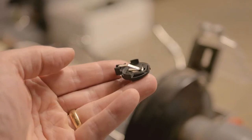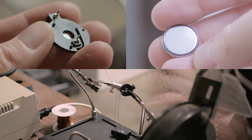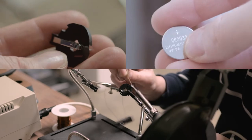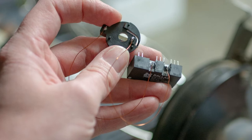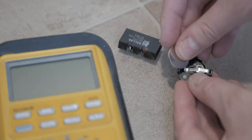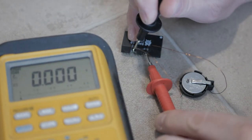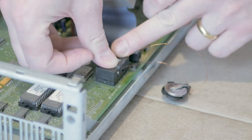I have a basic coin cell holder for a CR2032 size battery, which is then soldered to the jumper wires — being careful to ensure that the wire on pin 16 goes to the ground terminal of the coin cell holder, which is the domed part of a coin cell, and the wire on pin 20 goes to the positive terminal, which is the outer flat labelled part of a coin cell. This assembly is a little rough, but for now it should do the job. I will try to find another more durable solution later. Pay attention to the polarity of the CR2032 coin cell as it is carefully inserted into the coin cell holder. With another voltmeter test revealing there are no shorts, it's time to insert the hopefully now live DS1287 chip back into the motherboard of the PS1.